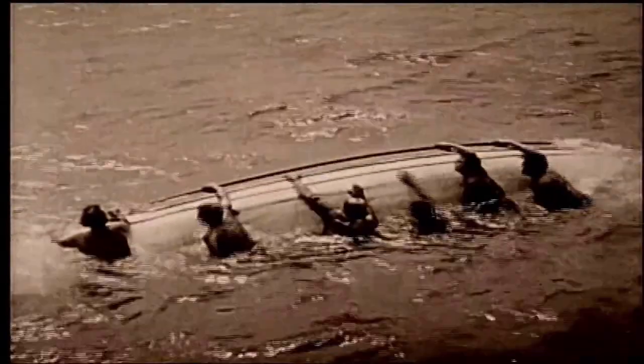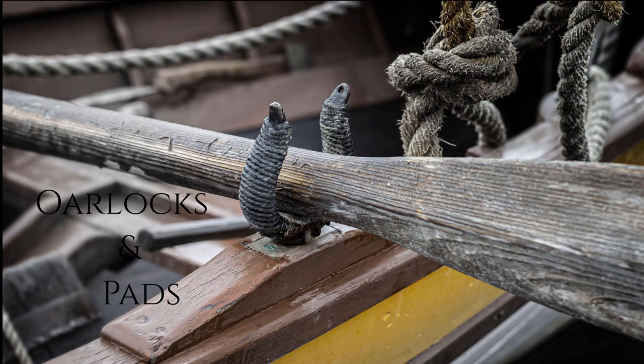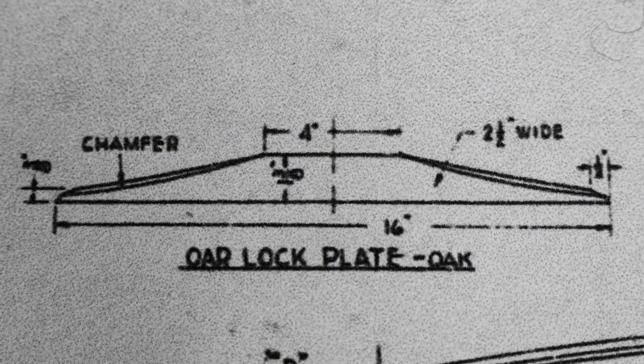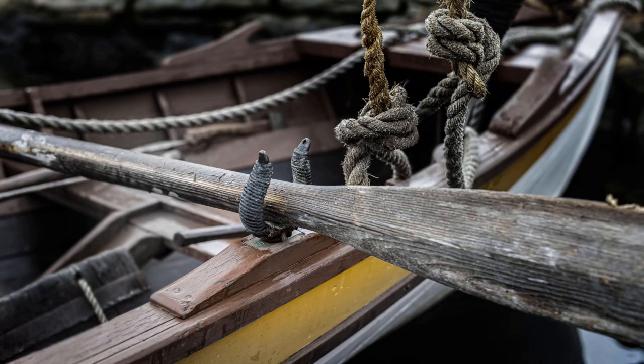The assembly gets glued into place. I'm going to start with the oarlock pads - these are pretty low-tech and straightforward. The plan I'm working from calls for them to be 16 inches long, by two and a half inches wide, by an inch and three-eighths tall. The flat section in the middle is four inches, and there is a hole in the center for the oarlock shaft. There is also a bevel on each of the sloping edges. I found that working at smaller scales like this, including this small detail resulted in the pad looking more like it was sanded too much, rather than having a nice crisp edge chamfer.